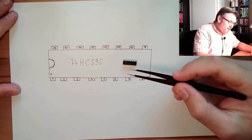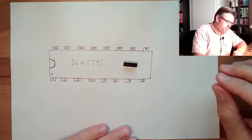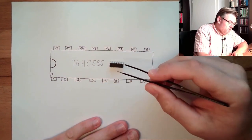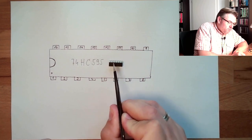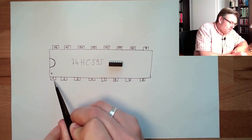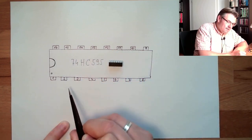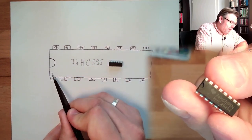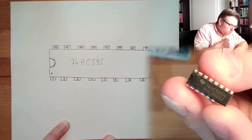Inside there is a tiny circuit made of semiconductor with a special technology, and this thing really does a lot. You need to take care about the notch here — you have two rows of connectors numbered counterclockwise starting from the bottom-left: one through sixteen. Some ICs have a little dot here; this one just has the notch.